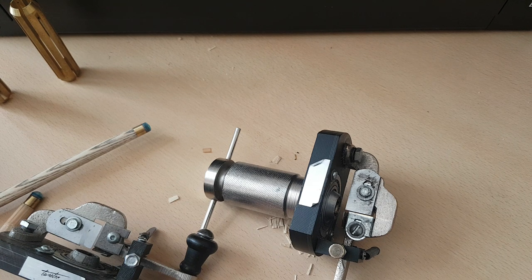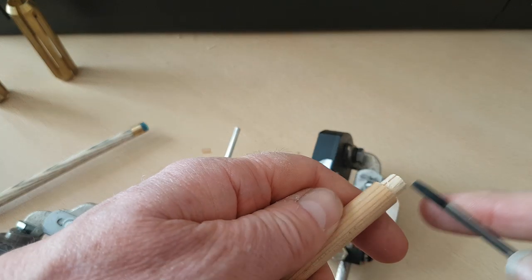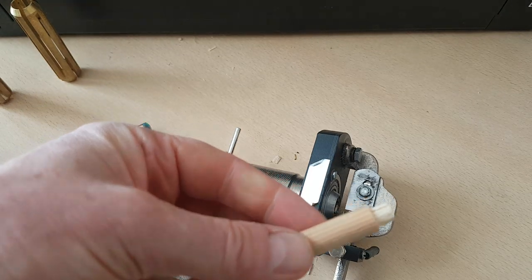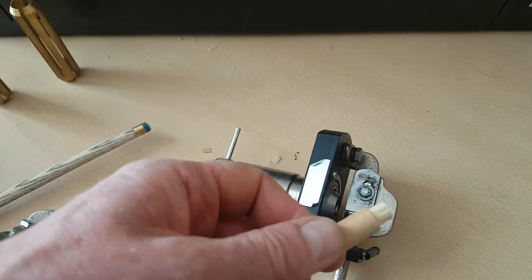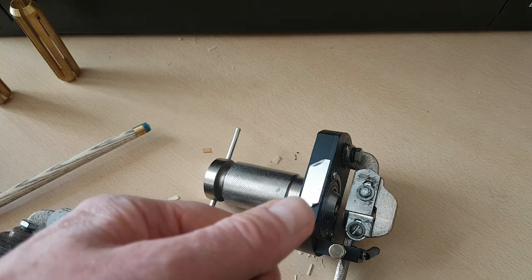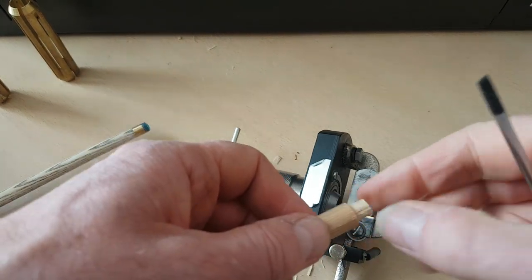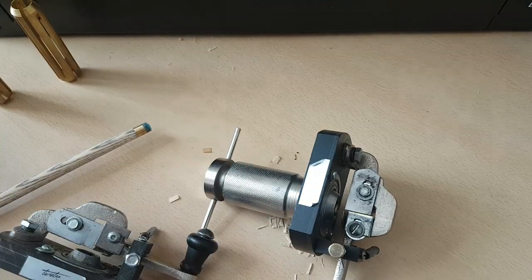Ripping wood around the tenon — if it rips around there and comes off in two bigger chunks, that's again an adjustment issue. I would use a practice tenon and fit new blades. Sometimes you can put them on an angle grinder or just file them with a file yourself — give that a go to start with — but make sure you record those positions. The bigger thing for me is making sure that the bottom one sticks out far enough, otherwise it will just tear straight down the cue itself.